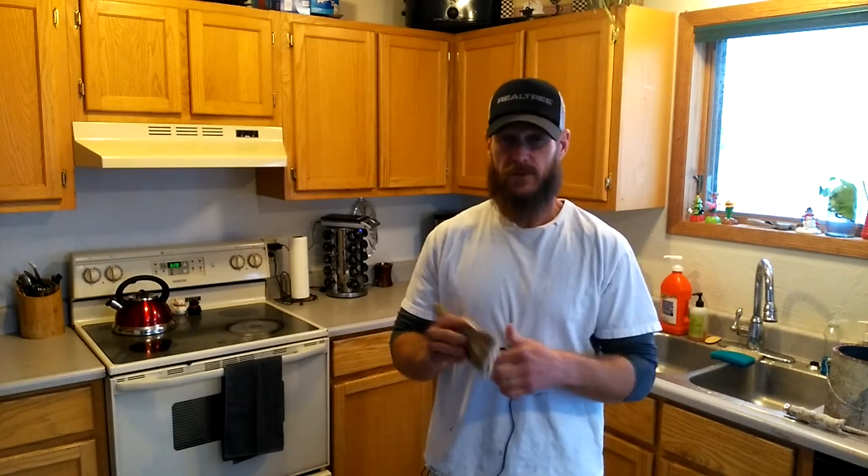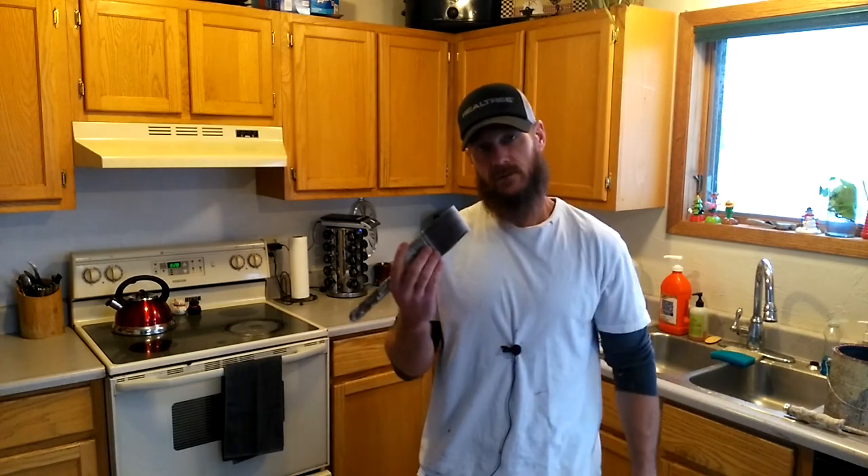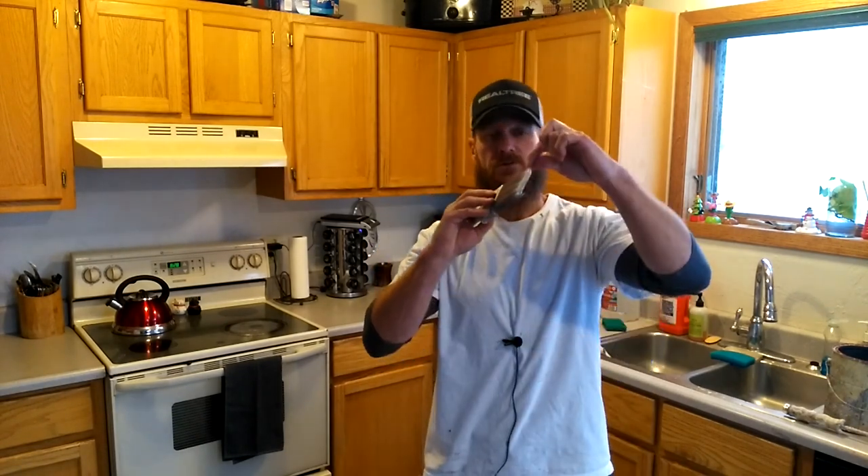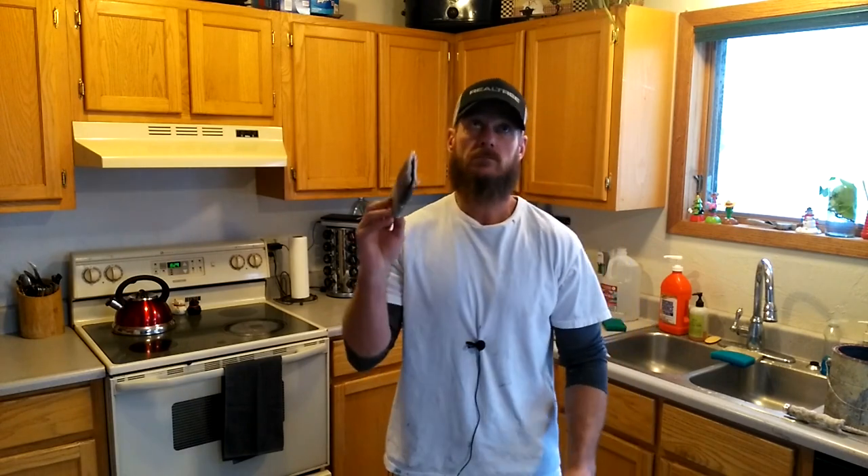Alright, of course, paintbrush — you're going to need that. This is an angle brush, it's a 2½ inch. I like to use a 2½ inch; it's kind of a happy medium between a smaller and a little bit larger brush. Some guys prefer a 3 inch, but it's an angle sash brush — it's a Purdy, Clear Cut. I like these brushes because they're pretty versatile. You don't necessarily need a flat cut brush; you could always use the angle brush for anything you could use a flat cut brush for, so why bother buying two different ones when you could just buy the one. This is really cool for getting up in corners because of the angle — it has a pretty sharp tapered tip.